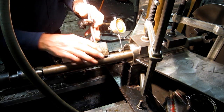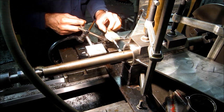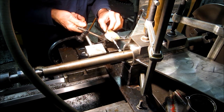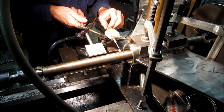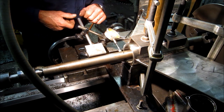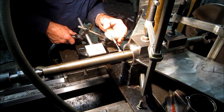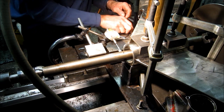This is why I like to really set up this mag base. I can lift up the plunger and I can swing this because I've already set the indicator so it's straight in line with the tool bit, and I can roll it one way or the other up and down the bar till I know I'm in line, and then I bring it down where I'm sitting right on that point. Alright, set a good 0 there.